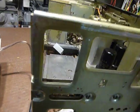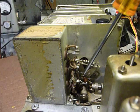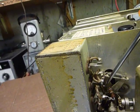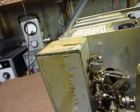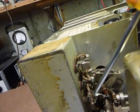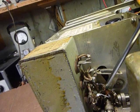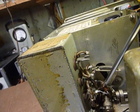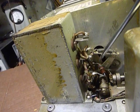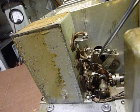With this one here, I connected it up and that choke coil that it goes through is right here — it's the bottom two connections on the audio output transformer. Those bottom two connections are actually a choke coil. I've got a 180 ohm 1 watt resistor across there. It's supposed to be minus 8 volts, and you can check the voltage right on this connection over here — that's where you can check your minus 8 volts.